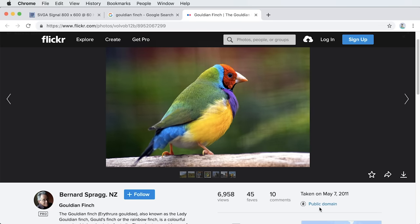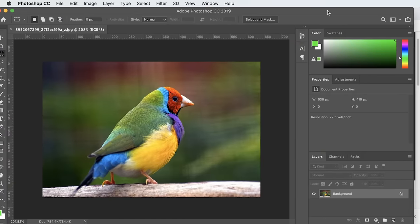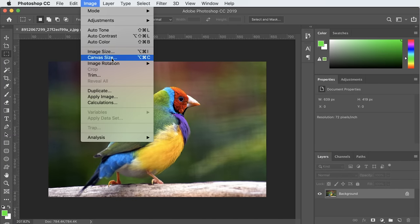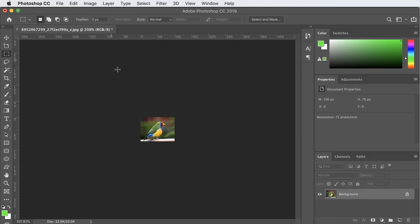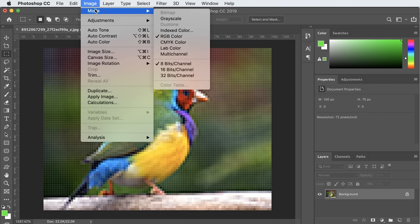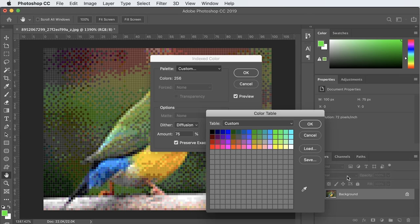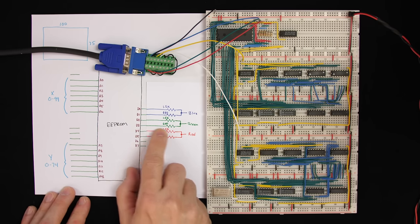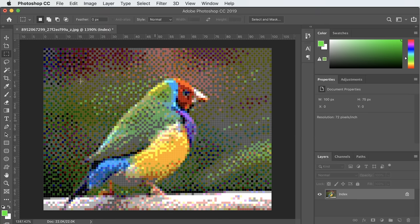This colorful public-domain image looks good. I'll download it and load it in Photoshop, then resize it to 114 by 75 and crop to 100 by 75. Now we need to change the color mode to indexed color with a custom palette — the 64 colors our resistor voltage dividers can produce, in the right order. For example, an index of 8 is a particular green, and if we have 8 in our EEPROM it produces that same color. After applying the palette, this is the image we get — 100 by 75 pixels in our 64-color palette.